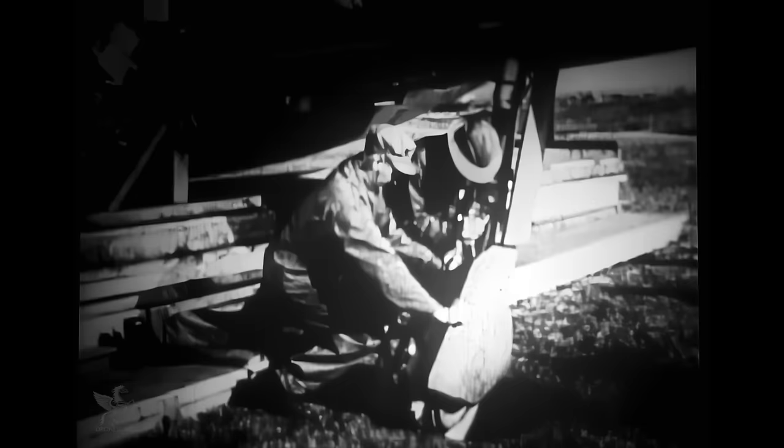Here is the reason we cut out that section of the platform. It would have obstructed the passage of the wheel. Notice, too, that the pits are dug quite close to the platform. In order to bring the gear down to the full downlock position, it is necessary for two men to get behind and push. When the downlock position is reached, an audible click is heard.